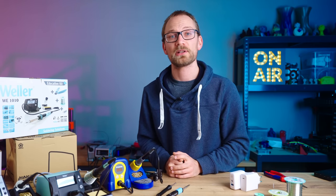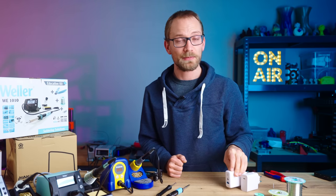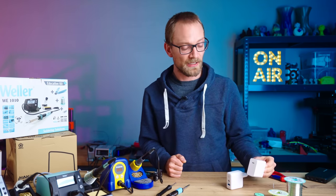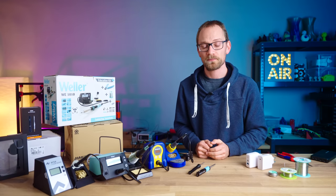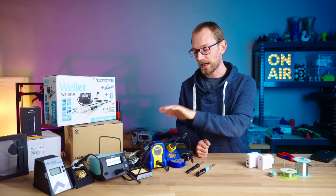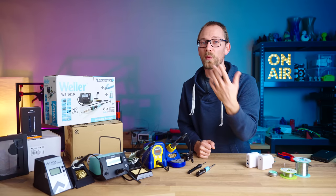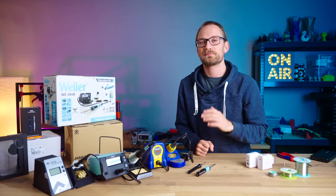There is a limited compatibility list on the website, but it ran at 17W with the power supply I usually use for my camera, about 30W with this USB-C power delivery power bank, and the full 60W using my Huawei laptop charger. Pine also sells a compatible power supply for $25 plus shipping fees and imports. The MiniWare comes with a power supply that allows you to have its full 30W of output power, the Hakko has 65W, the Weller is 70W, and the ERSA is 80W. My old station has 80W supposedly, but I don't quite believe that.